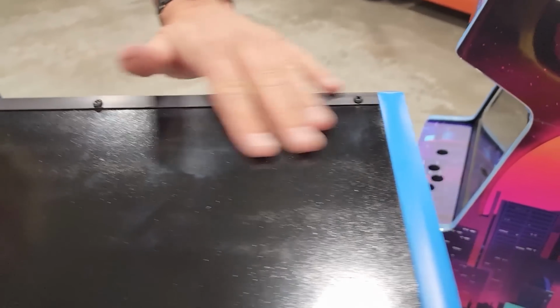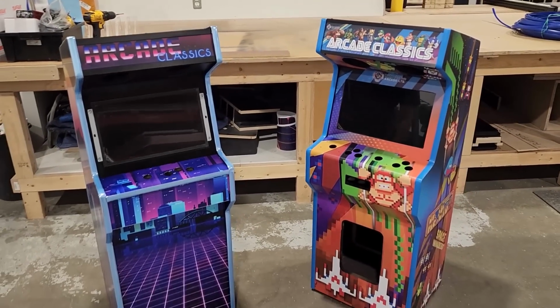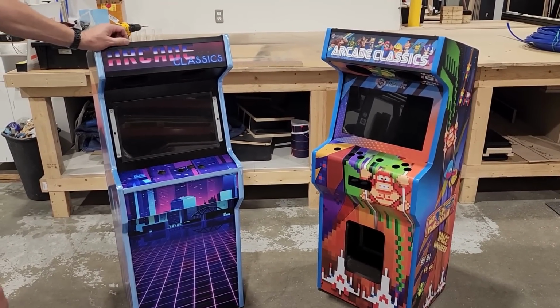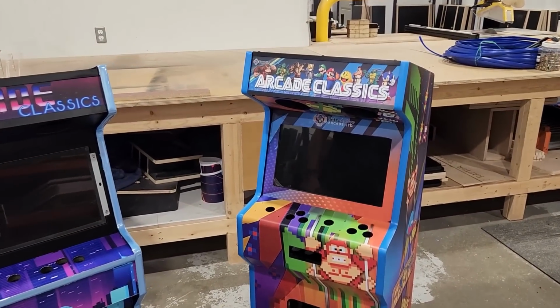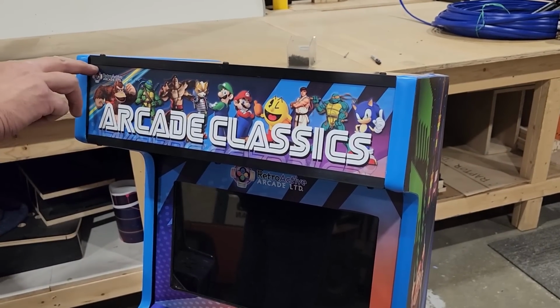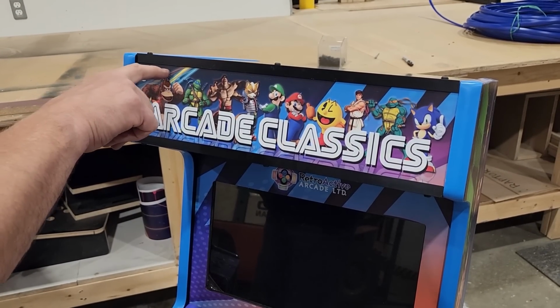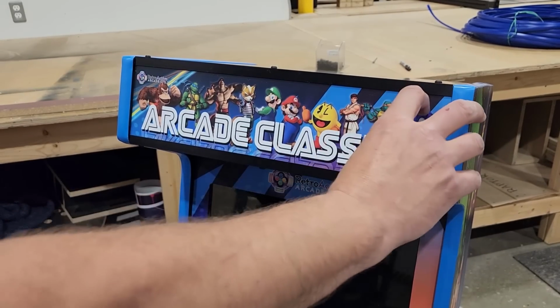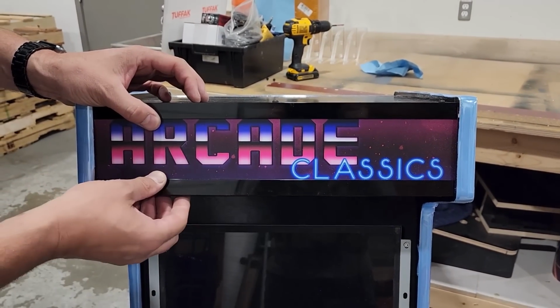All right, so that's it, that's all. Come around front and take a look at what they look like. You can see the two different thicknesses and types, right? So these brackets are obviously bigger, they're going to be stronger, that type of thing. These are smaller, they give you a little bit more viewing angle, all that fun stuff. The thing is, once this is backlit, you're going to see, because it's 3/4 inch material and this is only 1/2 inch, it's actually only going to light up below that. So you're going to get a shadow of the 3/4 inch, where here, the bracket's going to block that off anyway.